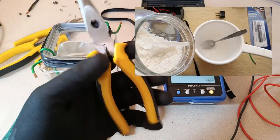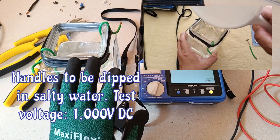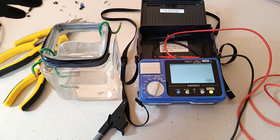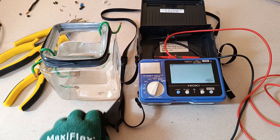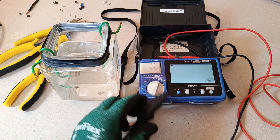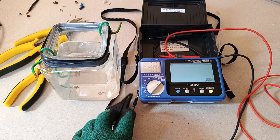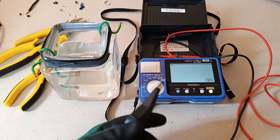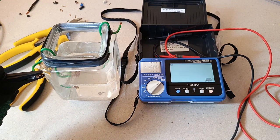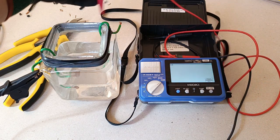Unintentionally, for that purpose, I fill this bottle with salty water. These two conductors here will be the connection point of one terminal of my Hioki IR4057 insulation and continuity tester, set at 1000 Vdc test voltage. To check first whether this saline solution has good conductivity, the reading should be 0 when I connect the two test leads of my IR4057.